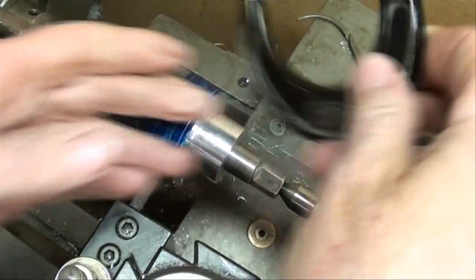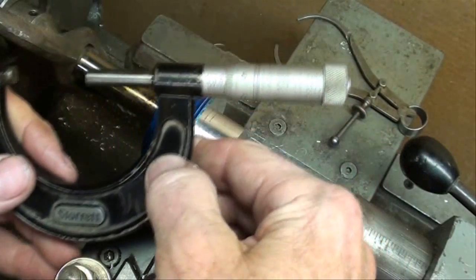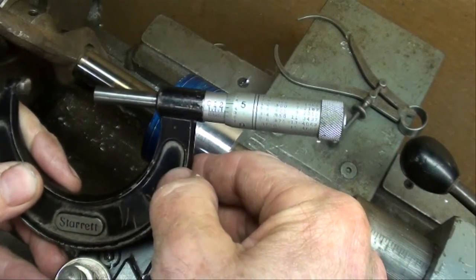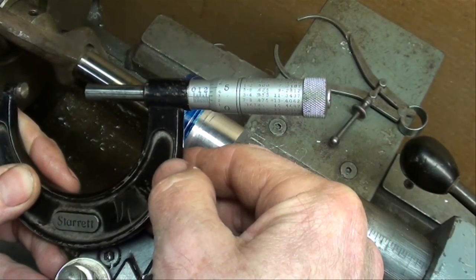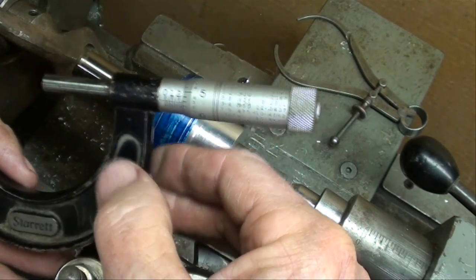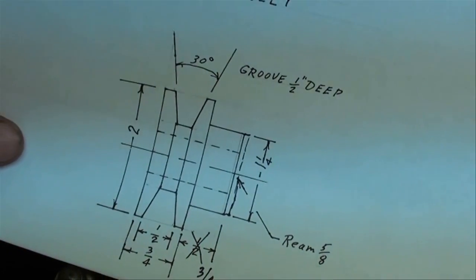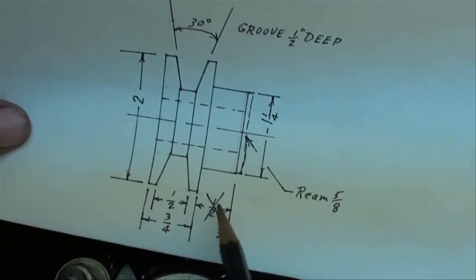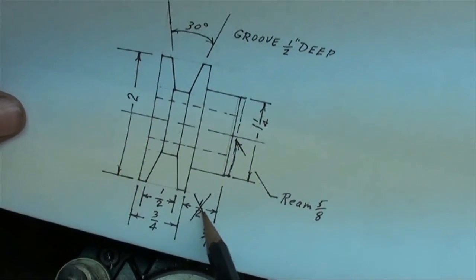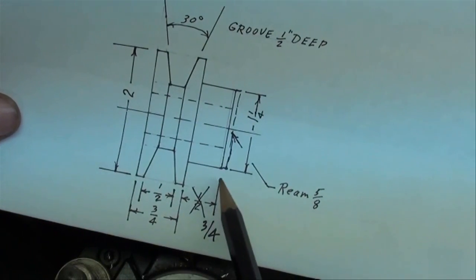It is now the next day — I think I forgot to show this dimension. I wanted that to be inch and a quarter, and we're within two or three thousandths, which is plenty close. Don't waste your time on dimensions that aren't critical, and that is one that is not critical. I made a change: I lengthened the hub from one half to three quarters, so the overall length is now one and a half inches, even though that's not shown on the drawing.